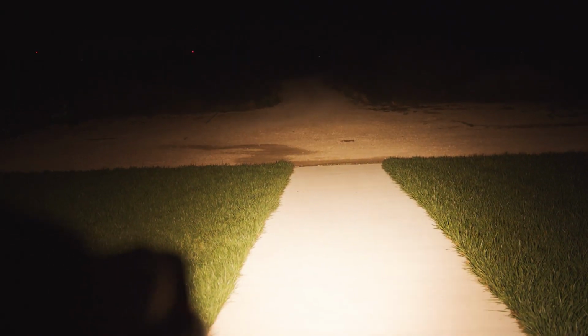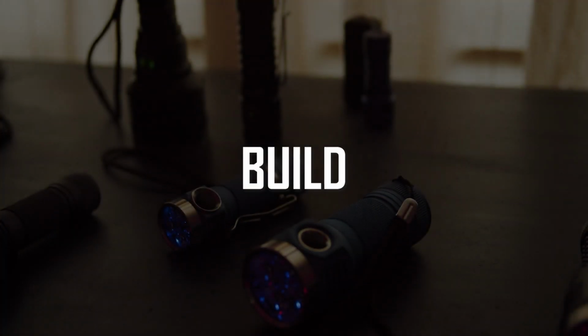Whether this is good or bad is really just a matter of preference, and many people intentionally order mixes of different LEDs to get a more desirable, more magenta shifted tint. I've seen some combos with Osram W1s and Nichia 219Bs, and I think that might be the best combination to get if you're looking to have both performance and color rendering in one package.